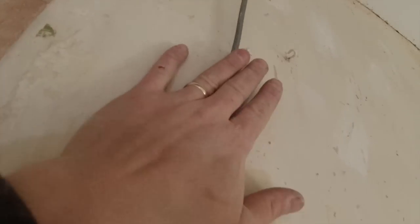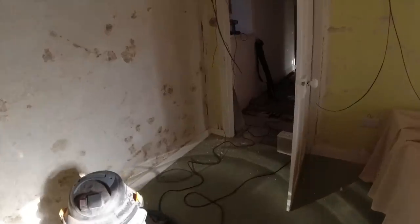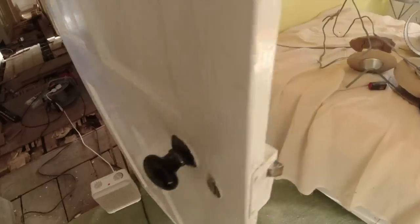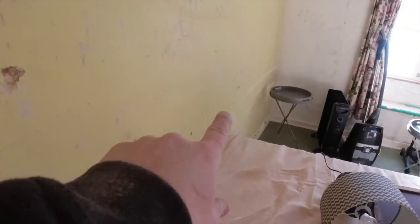There we go — that was where that hatch was. That's the beam we had to fish over. There's one wall light, and there's enough cable to flick along to the other wall light. So two wall lights. We've got our feed in which comes from the bottom, our feed out which goes over to that switch, a pendant switch line which goes to the pendant, and the wall lights switch line. And then a three-core for two-way switching at the bed here. They'll have a switch here up to a wall light at 1700, same over there.